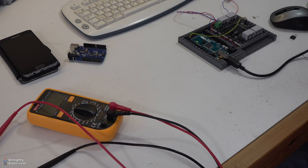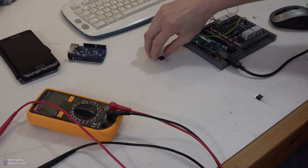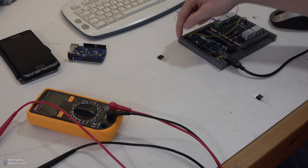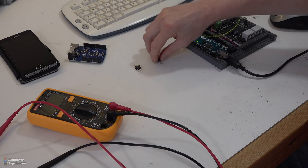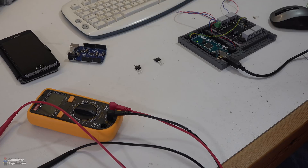I built a sort of temporary power supply for this shield. I'm always using 12 volts — either from a lab power supply or, if I need higher power, an ATX power supply. I need to go from 12 volts to a maximum of 10.5, so I decided to go for 9 volts, which is also above the minimum of 7 volts for this shield. I'm going to use a voltage regulator: I put in 12 volts and 9 volts will come out. The difference will dissipate as heat. From the 9 volts I can also make 5 volts with another regulator rated for 5 volts. It's a pretty simple method to build a small power supply.